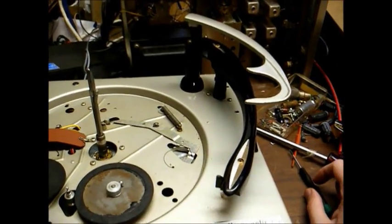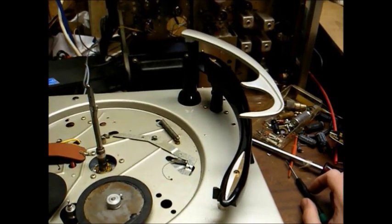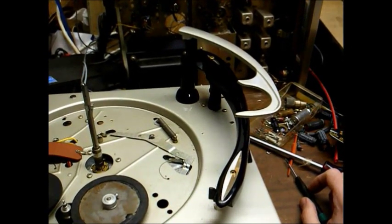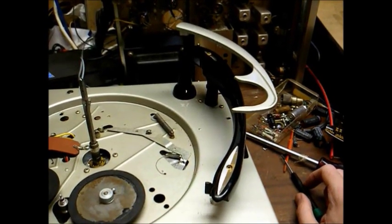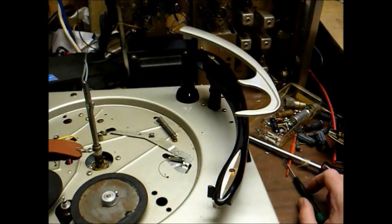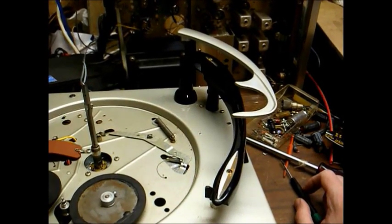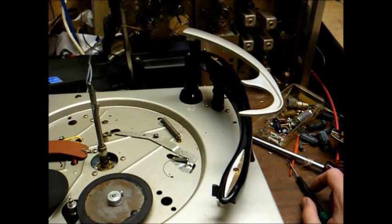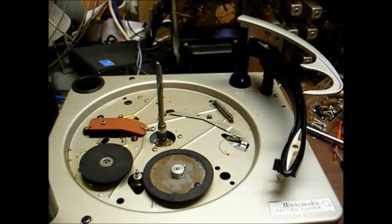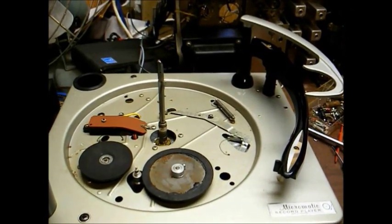I noticed while playing a record it liked to skip a little bit. I measured the tracking force, and it's running around 2.5 grams, which is a little bit low for this cartridge. I think these cartridges are supposed to track in the 3.5 to 4 gram range, so I'll double check that and set it to the correct tracking force,